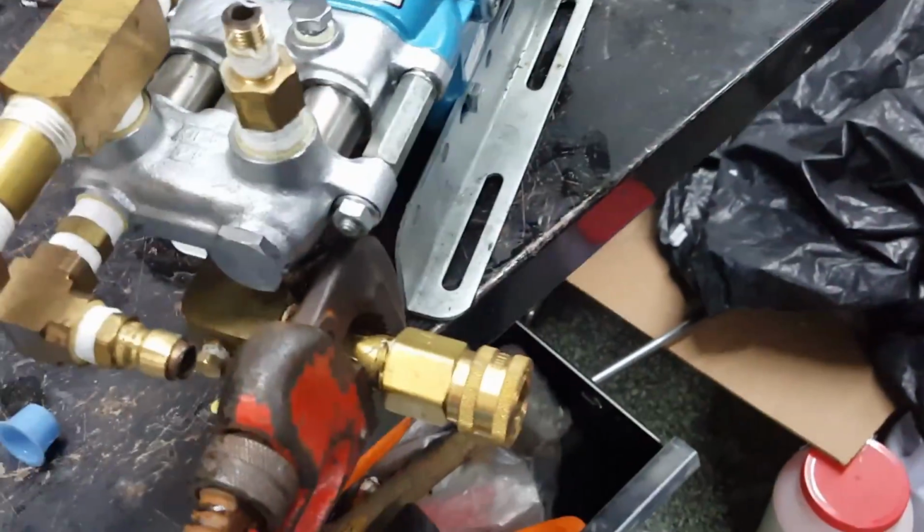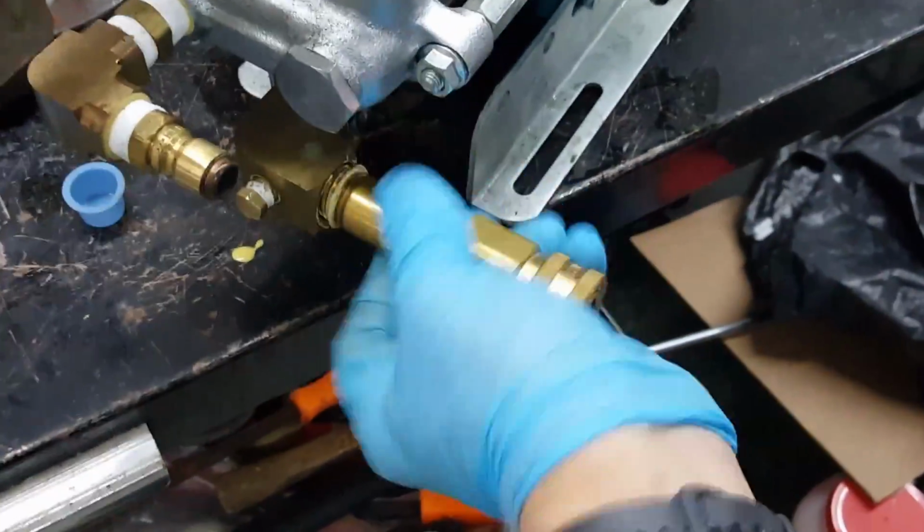And this little bugger here, you sometimes got to get that pipe wrench on there pretty good. So, take your time on her. And this here, you want to pull that whole part off of there so you can reinstall over there. My pretty pipe getting all buggered up. We'll do that, get it off, clean it up. Get some Teflon and pipe dope on that. Again, clean that up in the ends.